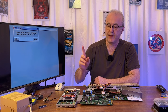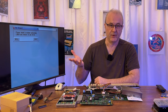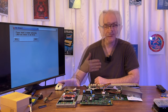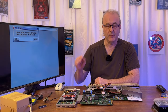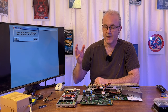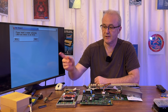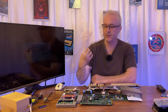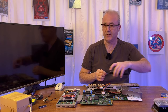This is where the real power of the Zulu SCSI comes in. The Zulu SCSI is based on a number of hard drive files which are basically virtualized hard drives — literally files you can read on a Windows 10 PC or a Mac. The tools I use run well on Windows, so that's why I use Windows. What we need to do now is take this SD card, copy it onto my Windows PC, and then do a little bit of work in WinUAE, which is an Amiga emulator. That will allow us to set up this machine in emulation, and then once done, use it on the live machine. So we'll turn this off, take the micro SD card out — a 64 gigabyte drive — and get it prepped.